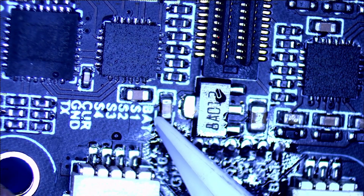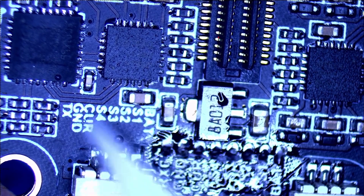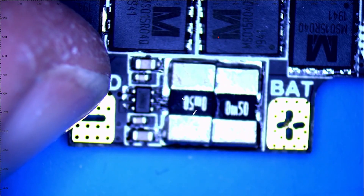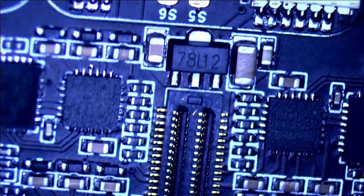Here is your actual pinout: battery, motor one, motor two, motor three, motor four, current — we talked about current — ground, and a UART, specifically RX6. Current sensing is only available because of the shunt resistors pulling up the reading for us.